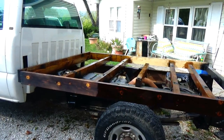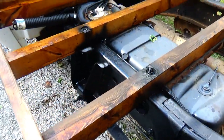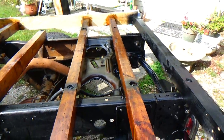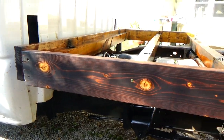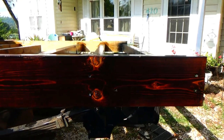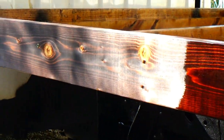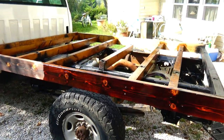We just did the 50/50 mix of some old engine oil and some diesel. We've gone through and done all the supports that are attached to the bed and soaked them down — we're going to keep coating them. I've gone down the side, hit it with my torch and charred it. That's what it looks like charred, and then this is what it looks like with just a little bit of the oil stain on it. I think that looks great — it's really beautiful compared to just plain wood. We're going to finish that and then do the other side and start burning the boards for the top.